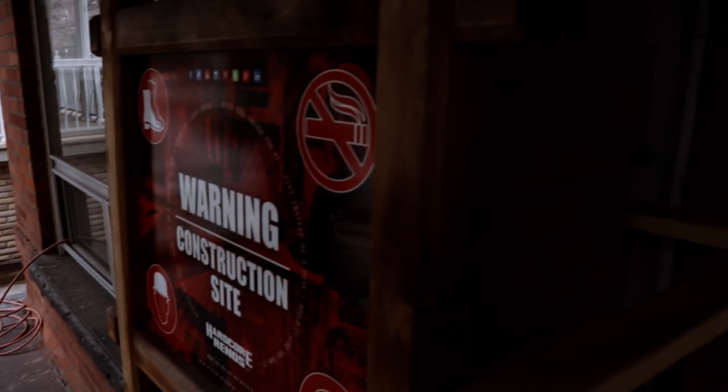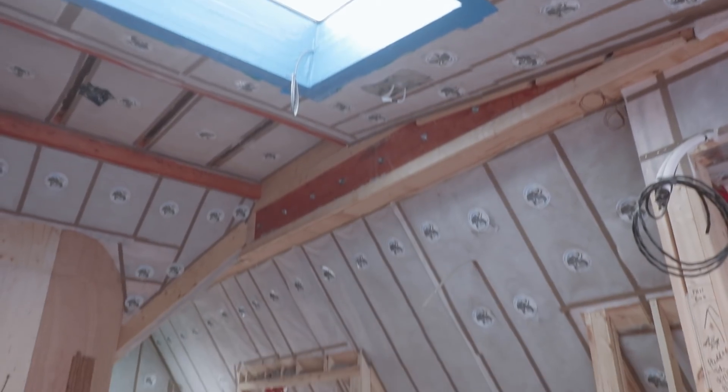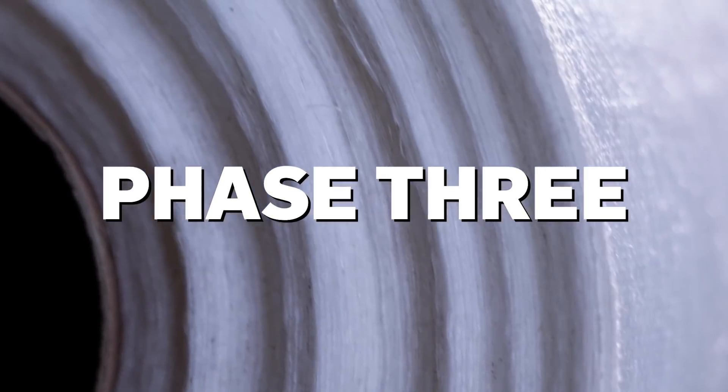So actually we're on my favorite floor. I've always been a fan of vaulted ceilings, but when it comes to insulation and all these intricate architectural details, it's a nightmare for insulation — that's why you need a product that can really conform to the angles. What we consider cellulose, it's like a liquid insulation, even though it's not liquid. You can actually get it into every little nook and cranny and make sure it's packed in there. Today outside it's about minus 12, and it's comfortable in here — this insulation must be doing something right. So we started with the spray membrane, and then got into this. Ideally, we're installing our vapor barrier first.